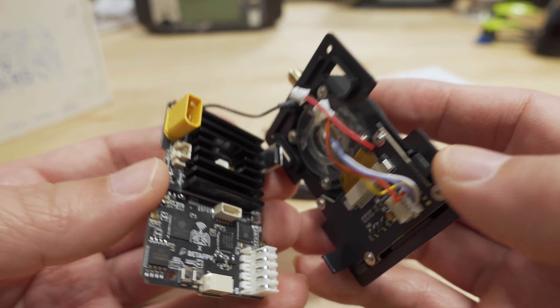On the backside of the main module board, the chips are likely under the heat sink on this side — that's where the heat is generated. There's also a UFL connector for the RP-SMA passthrough. I'm not an RF engineer or PCB designer so I can't comment on the design quality. Overall, if you want a one-watt module this is a solid option, and you could even pull the board out for a DIY project. Hopefully this has been informative on what's inside and how it compares to the 500 milliwatt design.